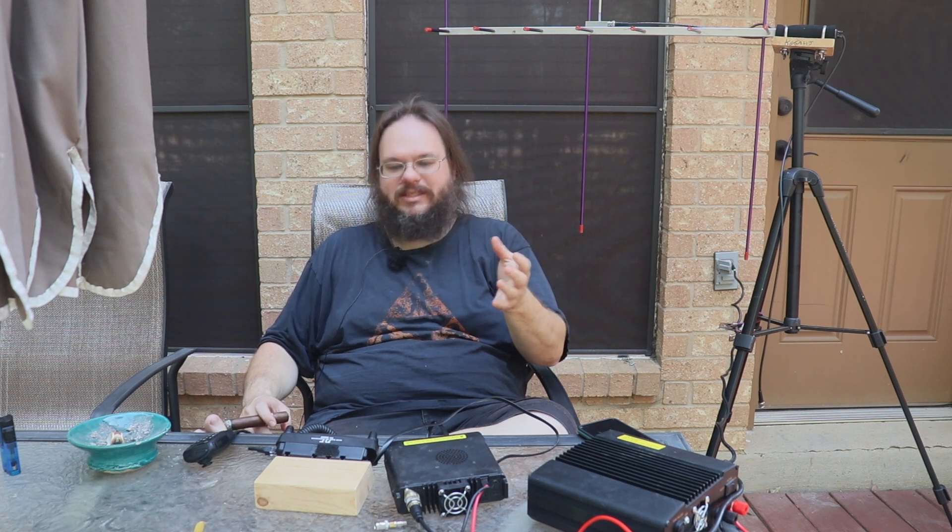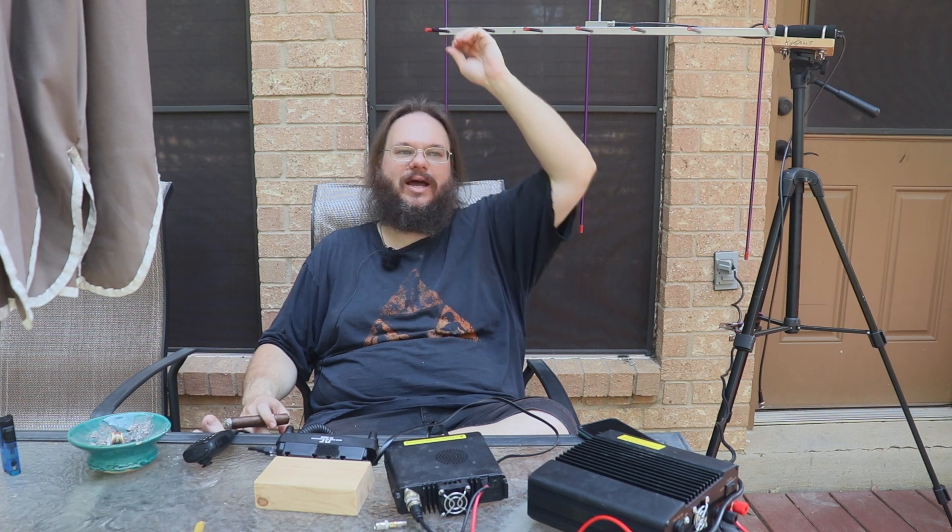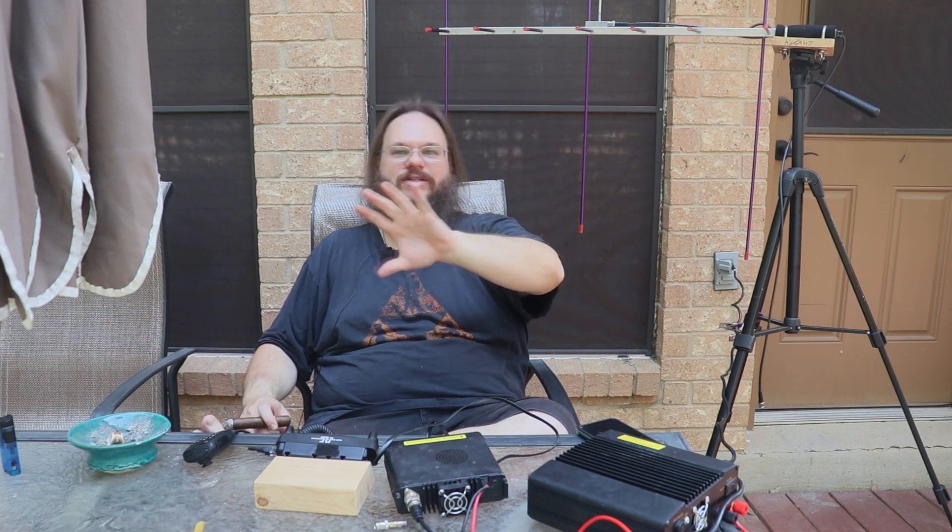Also, in good amateur radio practice, listen first. Don't just point the antenna at the sky and hope that you hit something — I'm going to guarantee you, you're not. It's going to take a couple of tries to hear the satellite come over, get used to tracking the satellite as it tracks across the sky, transmitting and holding the antenna at the right angle, and messing with polarization. That's all going to come in later. So in order to know that you're making it into the satellite, you're going to want a full duplex radio so that you can hear yourself coming back to you. When you hear yourself, that means the satellite is able to pick up your signal and retransmit it back on the downlink.